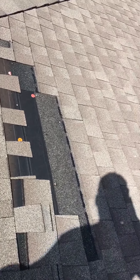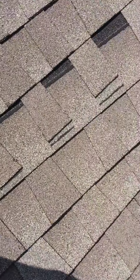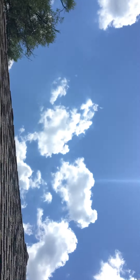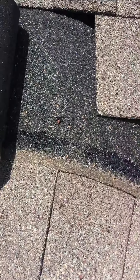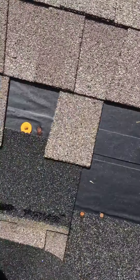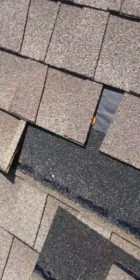I don't want to step too close to these shingles that are moving — else this video might take a totally different direction. Looking at some of these shingles that are coming apart and coming off, I see a nail hole right there that is definitely high. In some cases the shingles are going to be high-nailed like there and here for example. They are hitting the second course, which is nice, but you're missing them — like here. This is an example of where the shingle was high-nailed.